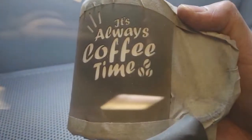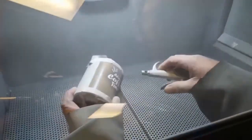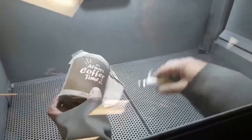No need to color, fill, or put any varnish or any kind of coat in there to protect that primer. That's designed to last for a lifetime, the way it is. No staining, no issues. If you do happen to get through that white primer and hit that beige ceramic material, it's more bumpy, it's like a tan color, then you probably need to color fill it with an oil-based enamel, or you could just fill it in with a varnish.